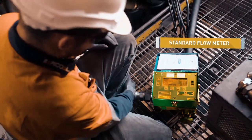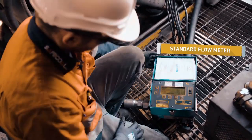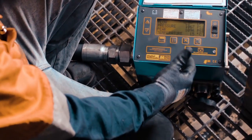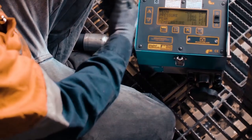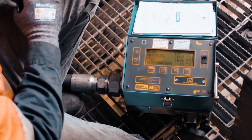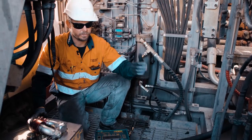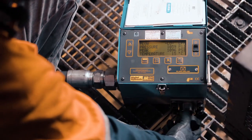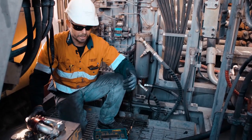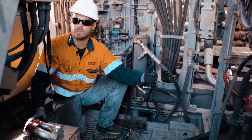You've got your pressure going in to the side and coming out the return, or the other way in, depending on what you're testing. Winding this valve here increases the restriction on your oil flow, and that's what builds the pressure up. You can check your pump flows throughout the pressure and flow curve — first check at say 47 bar, then check the flow rate was correct, wind the restriction up to the next pressure range, and measure your flow rates at that point, continuing right up to 294 bar, which is about 4,400 psi.